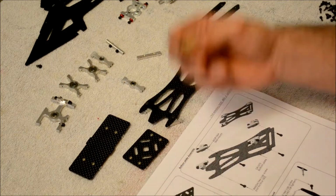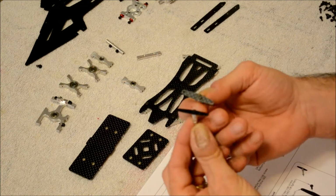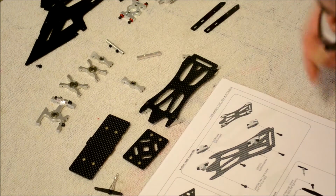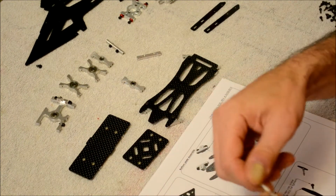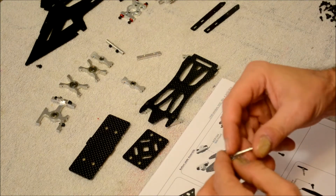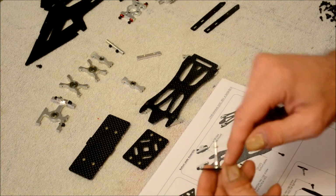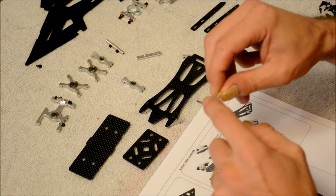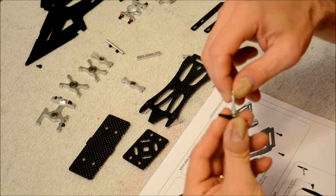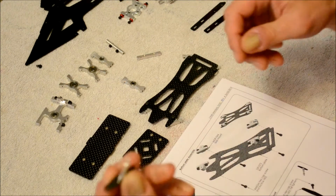And also mounting the breakaway canopy mounts. We'll go ahead and mount them. For me, I'll be Loctiting them. Now on the breakaway canopy mounts, you'll notice there is a washer that goes on prior to the actual canopy mount. So you'll put the screw, carbon fiber, that little spacer, and then your canopy mount arm. And make sure you blue Loctite them.